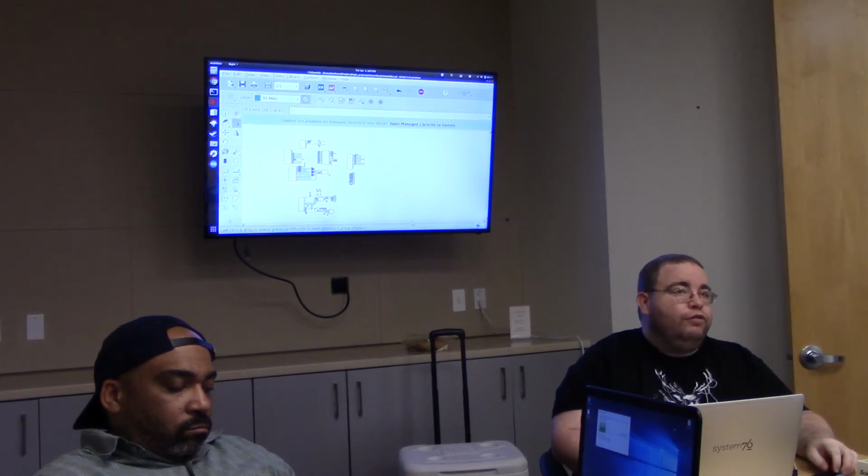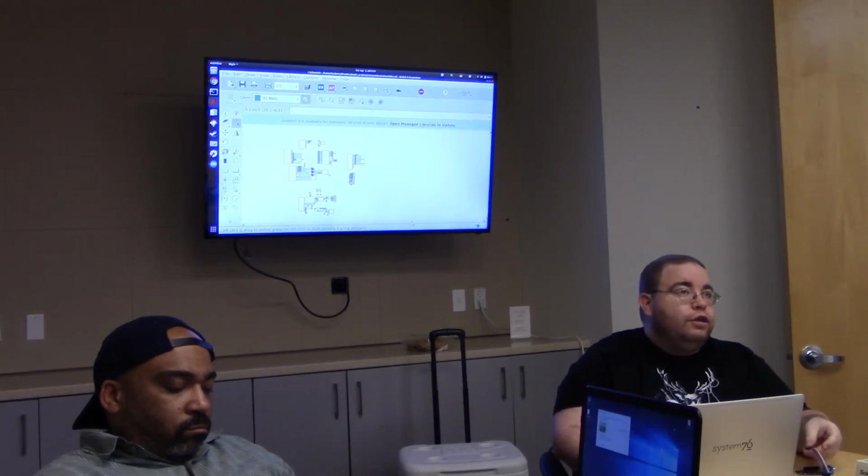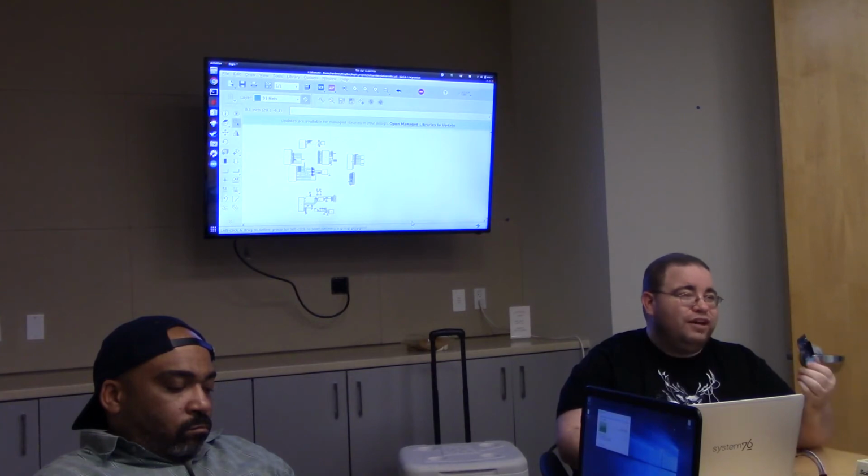You'll need to look more closely to see how many of those are LUTs and how many are hunks of block RAM and how many are flip-flops. But usually LUTs, which stands for lookup tables, or just a number of logic elements. I want to say this one has got 1,024 LUTs plus some number of things.